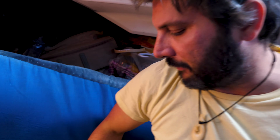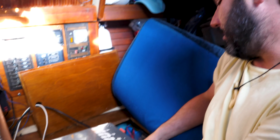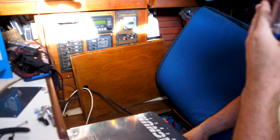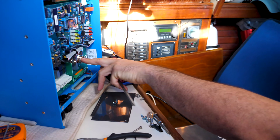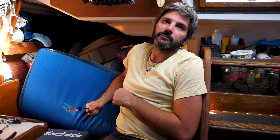I don't think we have to really film this install, it's actually pretty straightforward. It's just AC input from the shore power cable on deck — the dockside or Honda 2000 — output wired to the AC main which lights up the rest of the boat outlets, then positive and negative battery terminals. It's literally just AC in, AC out, and the two battery cables. I'm just going to go swap the wires out.